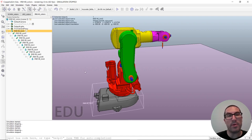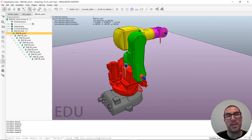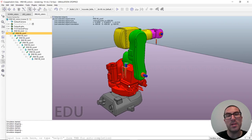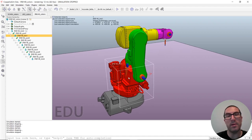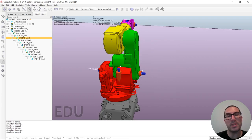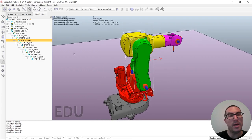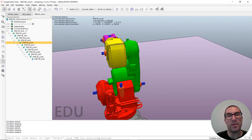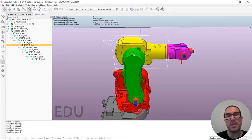Let's start with this robot. We have the base of the robot, which is the fixed link — it's named link 0. Then we have joint 1 here, which is a vertical joint that will be in charge of moving the first movable link, link 1, painted in red. Then we have joint 2, which is a horizontal motor — the axis is horizontal — in charge of moving the second link, colored in green. Then we have joint 3, which will move the link in yellow.